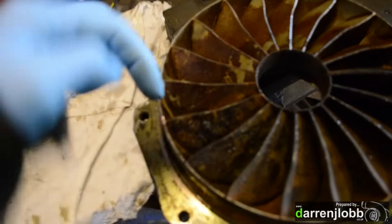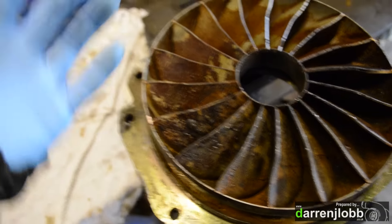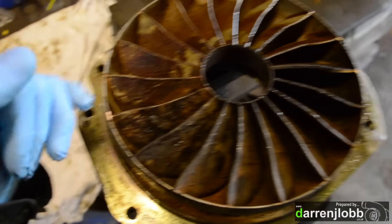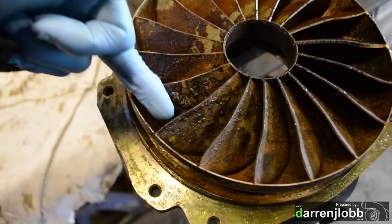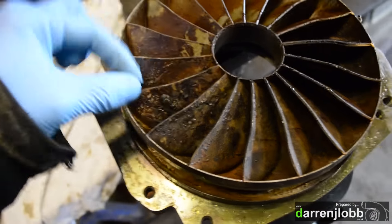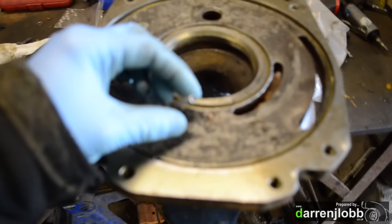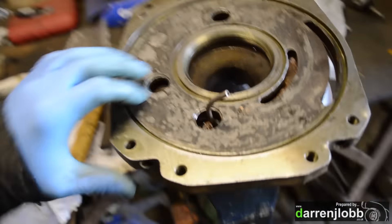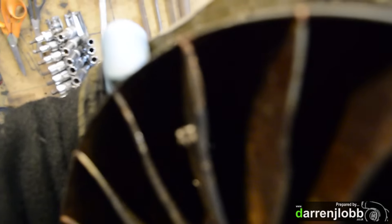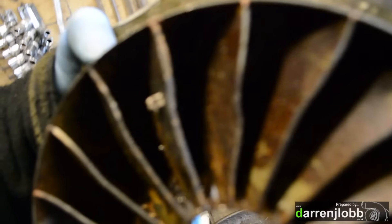As with one of my brakes we're going to have to make some modifications and basically remake the tunnel. As stock, the air actually has to go through a small hole in the bottom, then travels up through the vane and out of a little nipple — but the trouble is all of this gets choked up with crud and the passages are so small there's no way to clear them. So what I'm going to do is chop that off, drill a hole through the vane, then drill a hole straight down through the casting at an angle to pick up that waterway at the back. We'll put a piece of copper pipe in to replace that original feed, coming out through the hole and bending backwards because you get an air pocket in behind there.